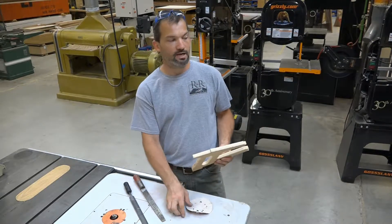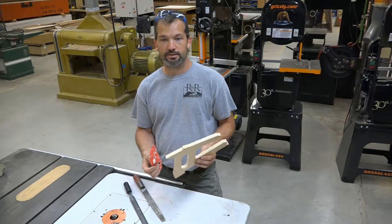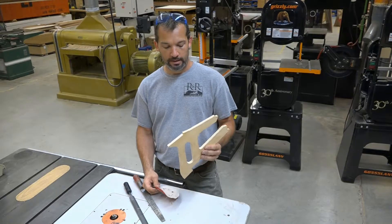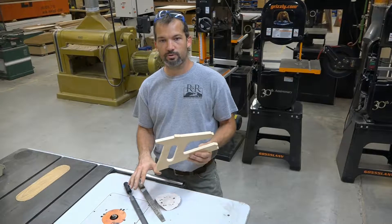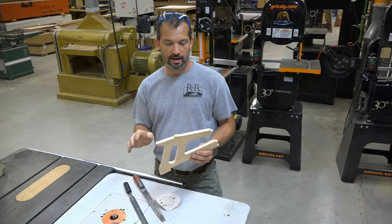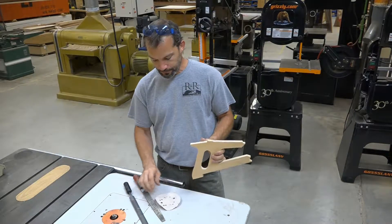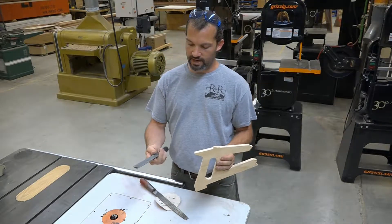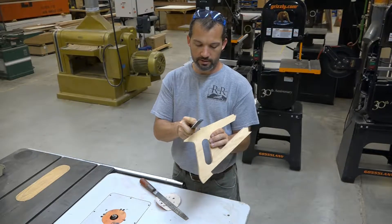I have students that oftentimes will get some 220 sandpaper, and three days later they're like, 'Hey, it looks beautiful,' but they've lost three days of the project. So always start with the most aggressive, get done with that, and then come back to the 220 if you're looking to impress somebody. I'm going to clean up the corners and the flats with my aggressive file first to try and clean those up.